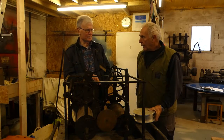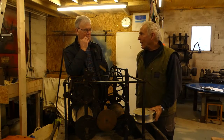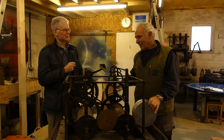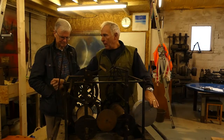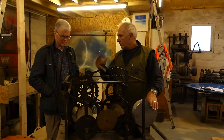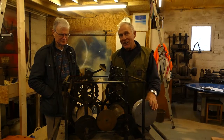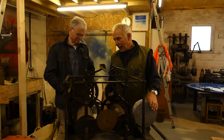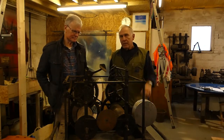And this strikes the hours? Only the hours, and it goes all through the night - 24 hours a day. I thought we were having a night silencing thing on it. We are. The bit that actually pulls the hammer, which will be up on the bell - we just pull that down and stop it. So you literally pull the hammer off the bell for the number of hours you want it not to work, then put the hammer back on and away it goes again.